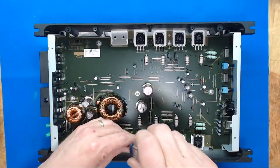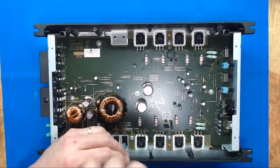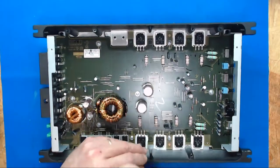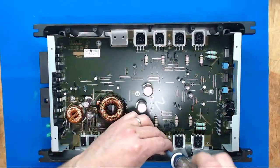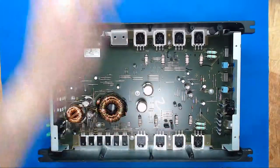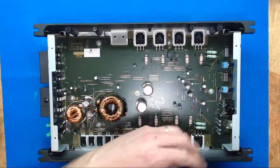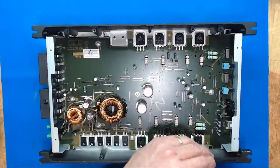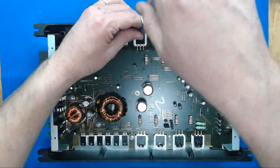And this is a common issue in these, and maybe you've got one as a starter amp or whatever, and you're getting that distortion. When you power the amp up, like I said, that was powering it up but wasn't actually feeding it a signal, just had the RCAs hooked up. You're picking up a radio station, and that causes your music to sound distorted when you're playing, feeding it power, because there's a whole different signal in there.